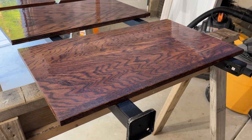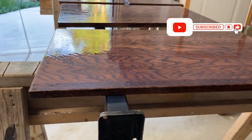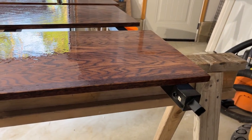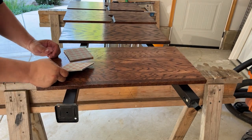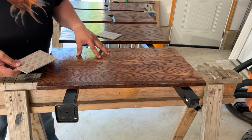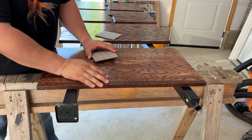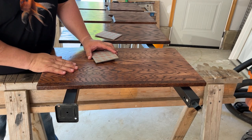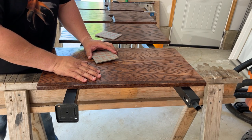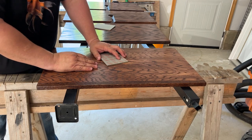Get at least three applications of top coat. It's very important to sand between each coat to ensure a good final finish — very clean and smooth-looking — and for adhesion of the coats on top of one another. Use a fine-grade sanding pad or sandpaper; I use a SurePrep Hi-Flex sanding sponge that's 220 grit. Before you start sanding, make sure the top coat is dry to the touch and not tacky — it typically takes between one and two hours depending on your location, humidity, and temperature.